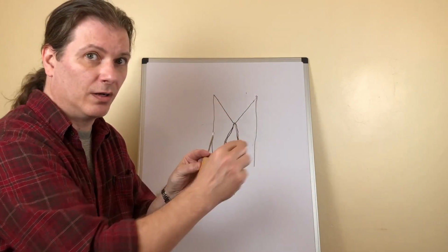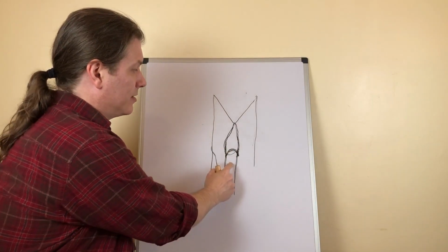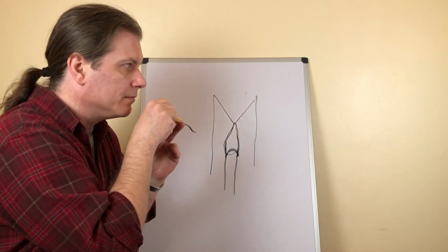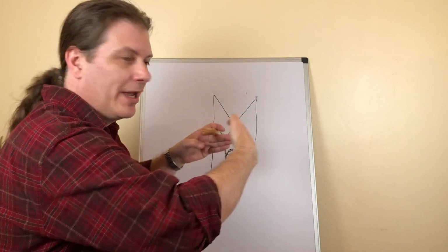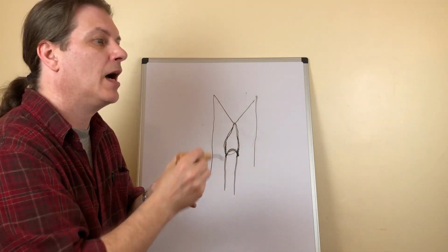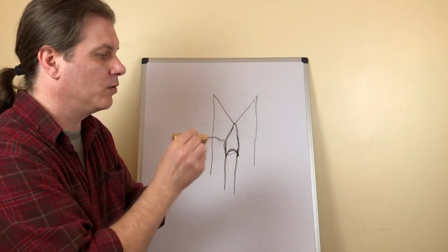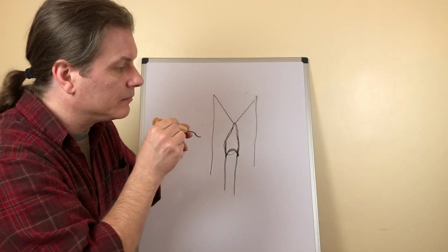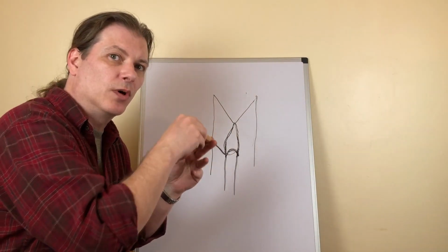Even though the overall is 90, I'm not thinking of it as 90 because I don't want to use it as one of these. I don't want to come into a corner straight at the corner, you know, and like plow my way in equally to both sides, because I would run the risk of burying both corners of the chisel. Whereas if I use this at a slight angle, I arc it and move toward one wall and then arc it the other direction and move toward another wall.